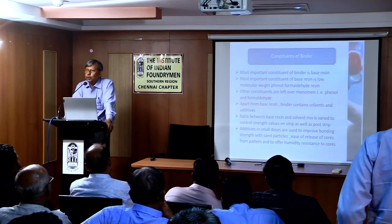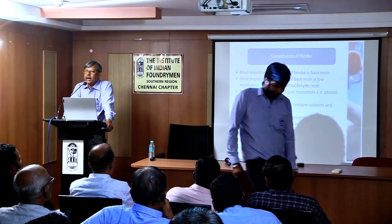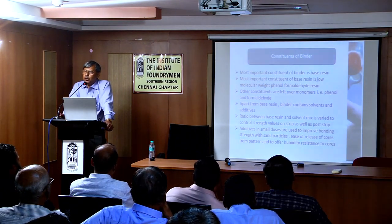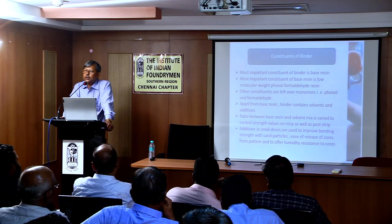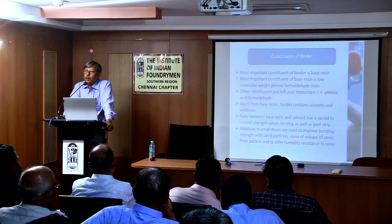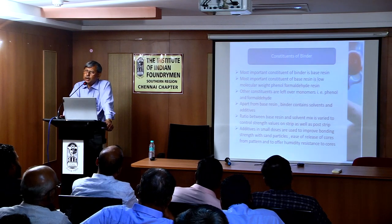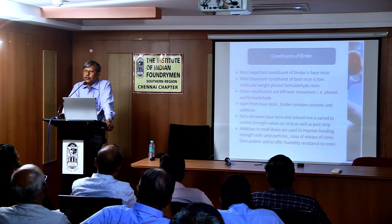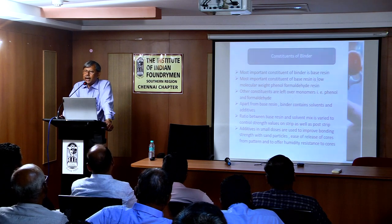Among solvents, I told you, the solvent must be a chemical without active hydrogen ion. Active hydrogen ion, in the simple sense that this isocyanate or hardener, which is also called co-binder, is used for condensation, for hardening of the resin. It is also called co-binder because you must have noticed that in any other polymerization system like furan, like 2-part phenolic, like pepset, there are some components which are added, just like furan.